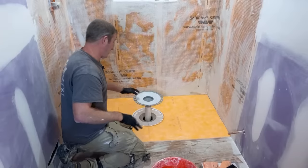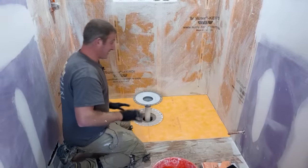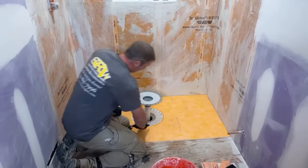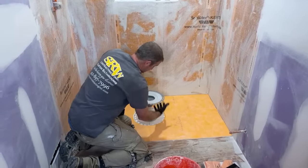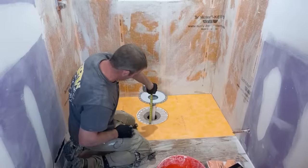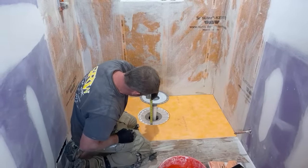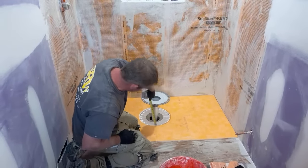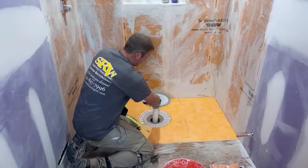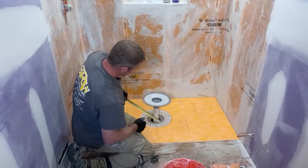And I'm not saying much. I would probably just give yourself maybe an eighth inch at most. Plus, we're going to have a little bit of thin set around here because you want to thin set this flange in. So just take this measurement, and most of the time I just cut it at that measurement, because the thin set layer and the additional piping that comes together will do.